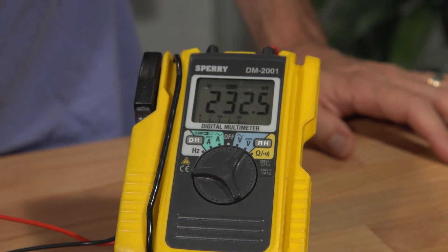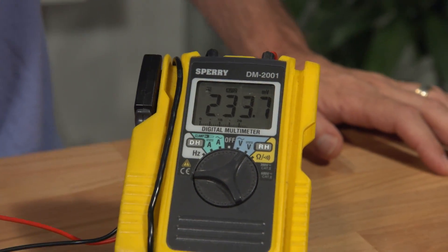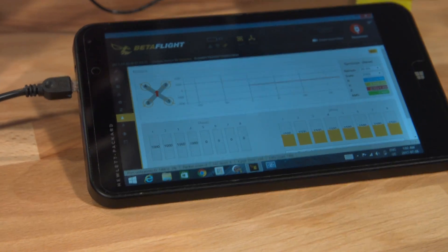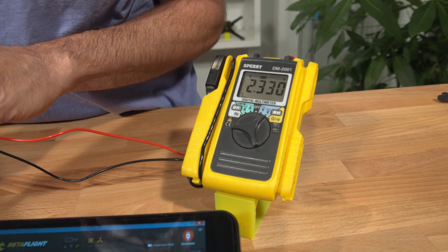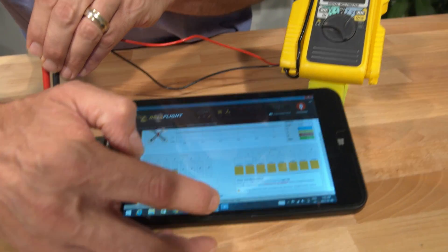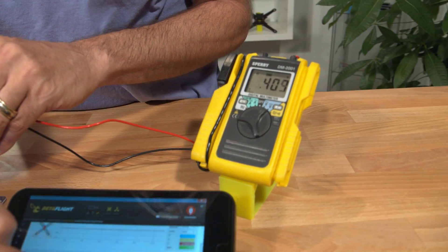The board is initialized and stable. And now we're looking at 233–234 millivolts — we are in the digital domain. So what do you think is going to happen when we move over to the motor sliders? All you digital guys, I know you're going to tell me that ones carry the same voltage as zeros, so nothing's going to happen. Let's check it out. Master slider up — we are at 234 millivolts, and here we go. Now we're at 409 millivolts. Let's bring it to roughly halfway — 382 millivolts. The digital signal actually varies up and down just like an analog signal.